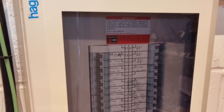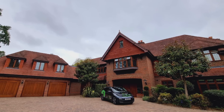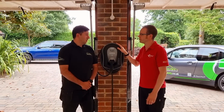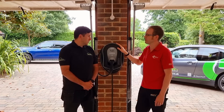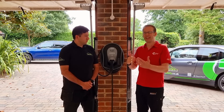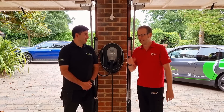It's a little bit unusual this installation because obviously we're in a domestic property — not what you would call a typical domestic property by any means, it's rather magnificent. But it's got that advantage of a three-phase supply coming in. So how does that help from a charging point of view? With single phase you can only have the seven kilowatts, but with three-phase here they've got a three-phase Zappi, so it's running, in effect, three single phases, totalling 22 kilowatts of charging capability. And of course you're getting that with a slightly lower current flow, which means your cable doesn't have to be quite as massive as if you were trying to stick all that down a single phase, which we probably wouldn't recommend.